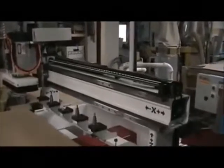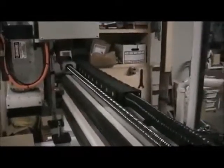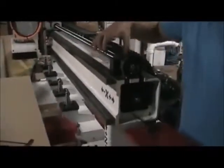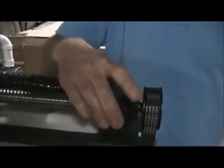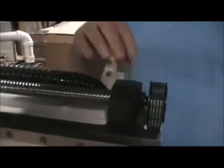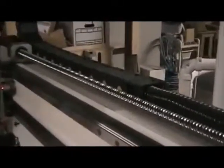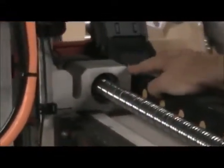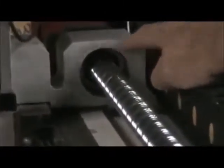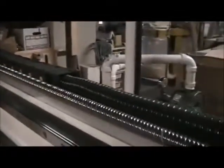Let's get a look at the ball screw. We've taken the cover plate off the machine here, and here's the ball screw across the X axis. Nice size precision ball screw here on the bridge axis. These are angular contact bearings on the ends of the ball screw, and this is a beautiful bearing set. I see a lot of manufacturers in this price range either turning their ball screws in brass bushings with no bearing at all, or using a very flimsy steel plate with a standard bearing shoved into it. If you look at the nice machined bracket for holding the ball nut — everything on here is real precise, real industrial quality machine tool components.